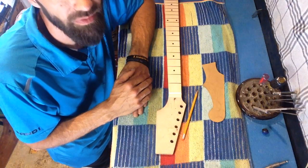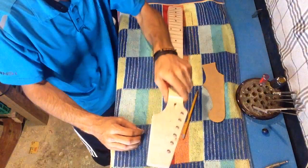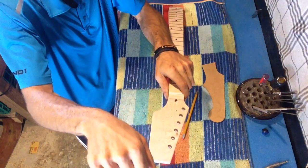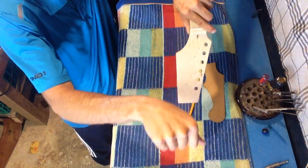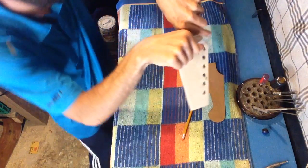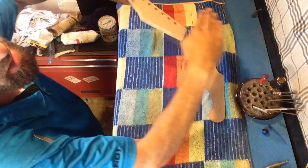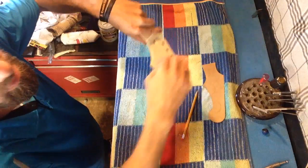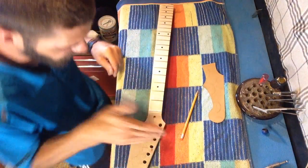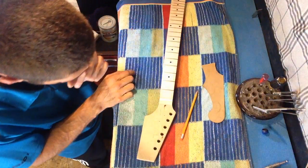It's going to be very, very difficult to do that, because I'm going to have to do it basically running my router straight. Actually, I'm going to have to be tilted like this and run the router flat across it this way. I'm, of course, exaggerating the angle there, so that as I slide it forward, it will dig deeper. And as it digs deeper, that, of course, is going to make the profile go in farther that way.